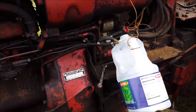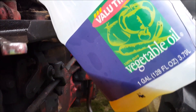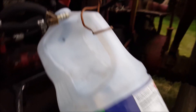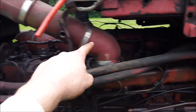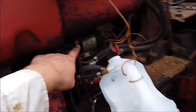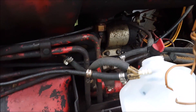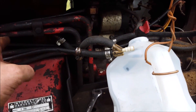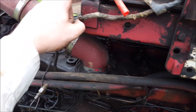This explains why I've been running only about 15 minutes at a time — look at that, it's barely trickling in. It was running just on what was in the filters and in the system. My return line is this braided metal line, so the excess diesel comes back and is supposed to go up this check valve, but it was leaking. I was trying to eliminate all restrictions, so I simply put this T in here so the return line comes in and just joins the main line and goes to the filters. So I brought my hand pump.